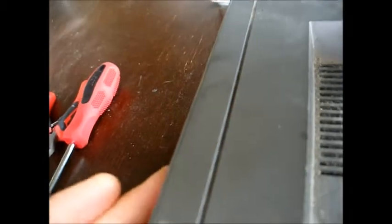Here's a little 5-inch black and white TV from 1986. You can see what it does. Don't know if this is weak batteries or not, but the screen, the only thing that works. You can see it flashing there. So I wonder if that's caused by old leaky bad batteries or leaky capacitors like this.